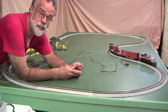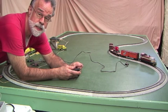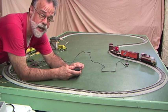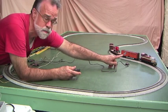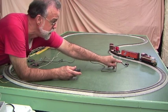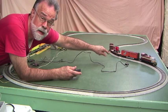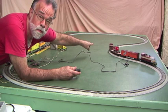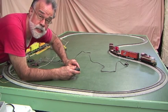We've got the same setup as before when we were doing automatic station stop using the push button to start the train when we had one train operating. Now for two-train control, it's basically the same setup except over here, instead of having the push button on the end of the wire connected to the acceleration terminals, the push button has been replaced by a reed switch. So instead of pushing a button to start the train that stopped on the block, this second train will go over the reed switch and activate the acceleration terminals of the station master, which will start the train waiting on the block.